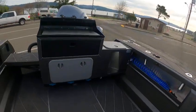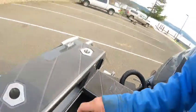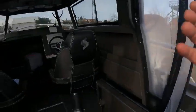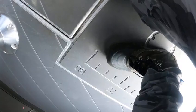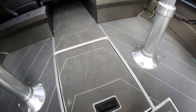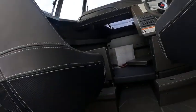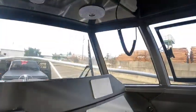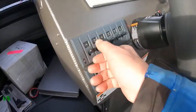Turn these on right here. The yellow switch — don't use unless you're running low on juice, because it'll pull both batteries down and you won't be able to start the motor. Make sure you always put that drain plug in because it goes straight through the hull to the water. Port-a-pot is right there. Wash the boat, take it out, let it drain, then put the plug back in. I put in 30 gallons of premium gas. Got the Fusion stereo linked in, an FM wire wouldn't hurt on here. Cup holders — thank goodness — and transom lights.